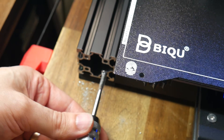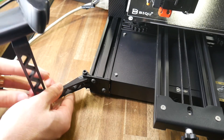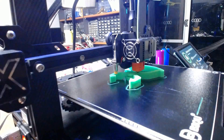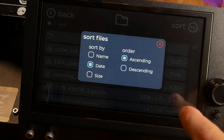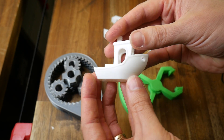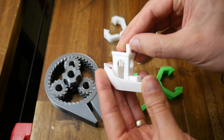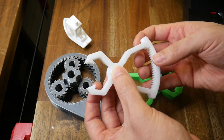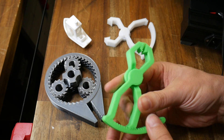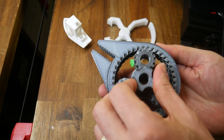To make the most out of OctoPrint, I tapped two holes in the left-hand extrusion, printed out an Ender 3 webcam mount, and installed it to the left-hand side of the printer, which allowed me to complete some OctoLapses. Set up like this, the printer was making a lot of sense and performing very reliably. The prints were coming out quite well, especially considering I was just using an Ender 3 Simplify3D profile with reduced retraction to suit the direct drive hotend. PETG printed fine and had no trouble sticking, though I did break one part trying to separate the two halves. The PLA reprint worked out really well. This printer would benefit from some tuning, but there's nothing in these tests that worries me.